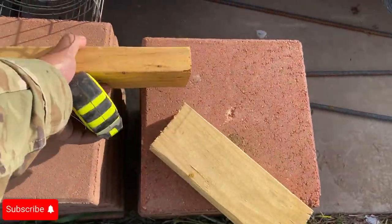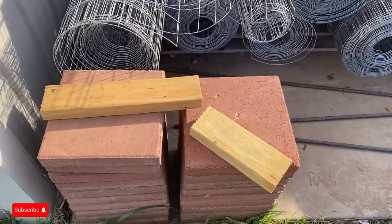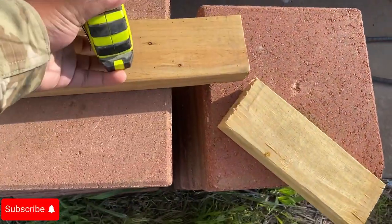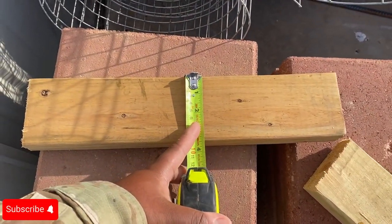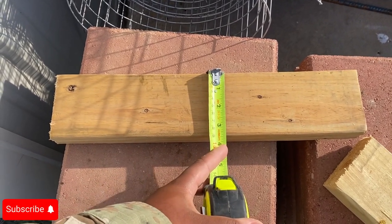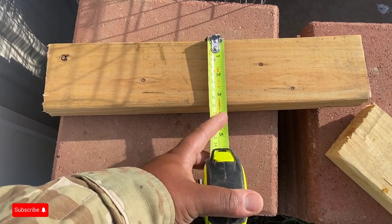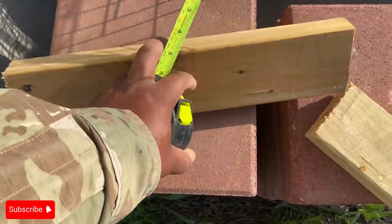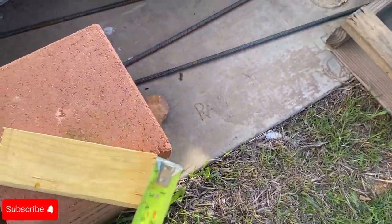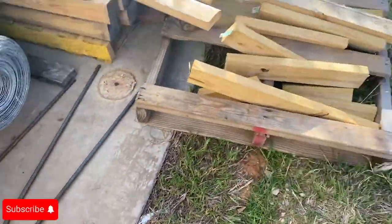This is why people have a lot of overlap in their building — nobody's ever shown you that. Chances are you could have dropped a thousand bucks or more on lumber trying to build something for the first time, wondering why your measurements are off. That's because a two by four is ripped or milled from a piece of wood that starts off as four inches wide and two inches thick, and they mill it down to three and a half inches wide and one and a half inches thick.